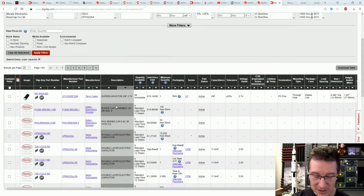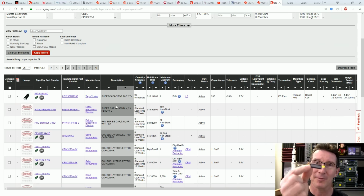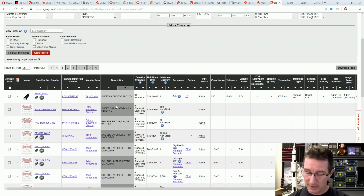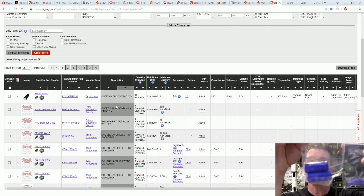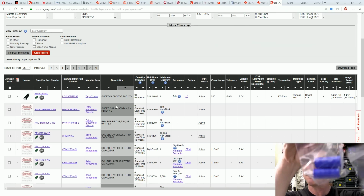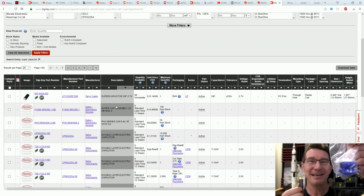And really what I want is an SMD, like a small solution. I'm going for a small LCD like this. Once again, your mileage may vary, but I'm going for an LCD something this small. Ideally, I want a tiny little source for it, right? So if you go up to a 1 farad capacitor, that's what a 1 farad supercap looks like. That's 2.7 volts. That's an AVX job, really top quality. That's a 10 farad one, and that's a 50 farad, 2.7 volts.